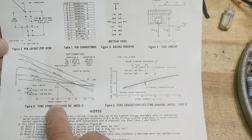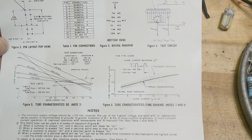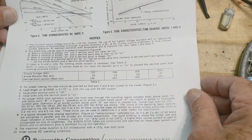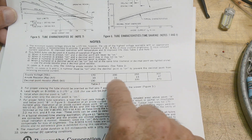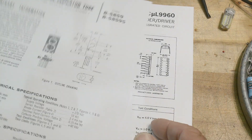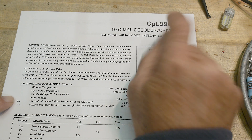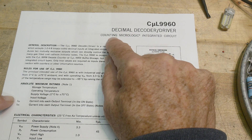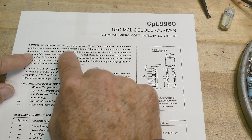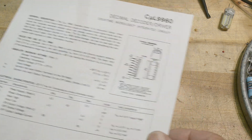Tube characteristics - anode current. The load lines change depending on what currents and stuff. I've never really looked at a Nixie data sheet before - that is interesting. Anode resistor: 10k, 18k. So we'll call this chip of the day. Chip of the day is a CmicroL 9960, a decimal decoder driver - counting micrologic integrated circuit - a monolithic silicon circuit which accepts 1, 2, 4, 8 binary coded decimal and then decodes that into Nixie tubes. So it's meant to be a Nixie tube driver.